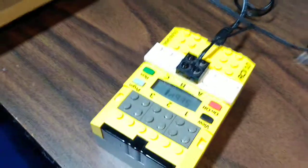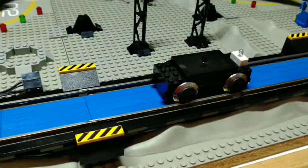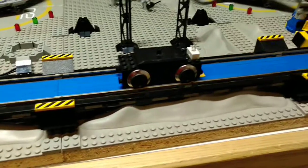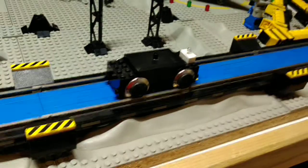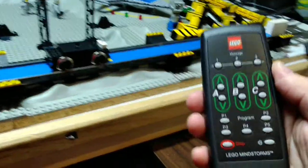So with LDC 1.05, you download the firmware onto your RCX and then you have to jumper all the motor outputs together because this requires a lot of amps. It goes from the RCX to a train connector to a motor that has a DCC chip inside. I actually converted a few motors years ago when we were doing train shows to have a DCC chip inside.